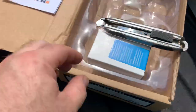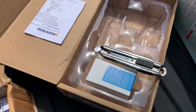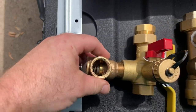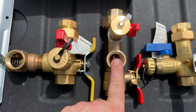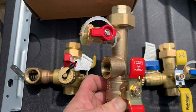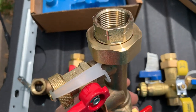Hot side: Watts, or Navien, ships the relief valve in a box separate in the packaging, as you can see there. Webstone does also. I've threaded it in here just to show you the difference. The relief valve on the Watts/Navien Plum Easy valve threads into that three-quarter inch port there. You've got your red handle to signify the hot side and an O-ring seal on a union nut.